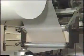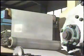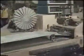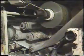When the paper fiber cotton is sent through the shaping web, it is sprayed with adhesive, as is the inner side of the absorbent sheet. Then it is wrapped tightly by the folding board to form the absorbent body. The absorbent body will be embossed solidly to increase its strength. Finally, it will be cut and trimmed by the circle knife.